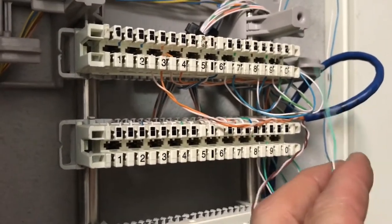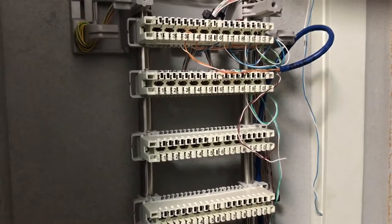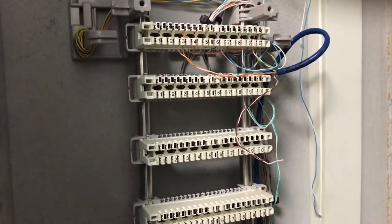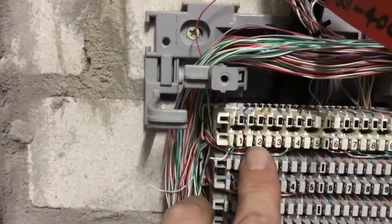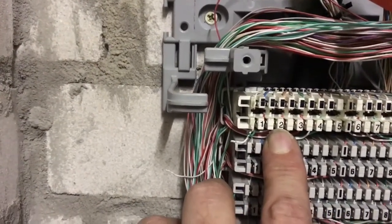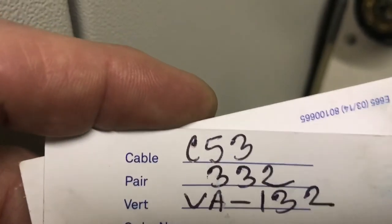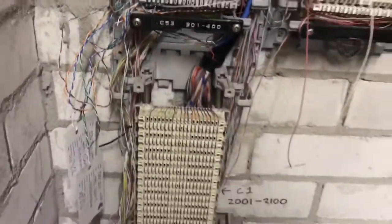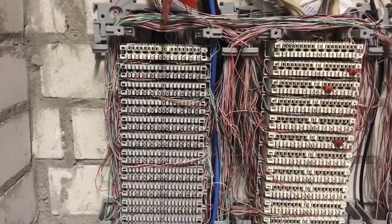If there's another issue, someone else will have to work that out. I'm here for a different number, so I'm just going to put it back how it was. The cable that was coming from the IDF was on this one here, and there was nothing labelled on the A side to find it. But I did find a card here with your service number, and it's got the pair — vertical A132. So I've just rerun the jumper to that, and we've given you the new pair coming down because of the other pairs — how they were all jumping into the one, three cables all in one.